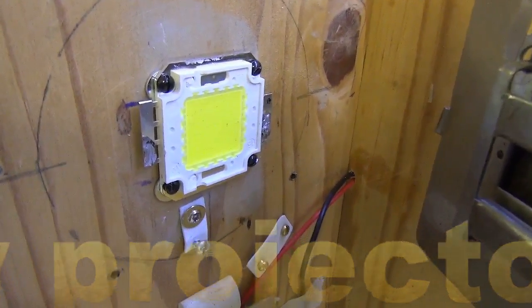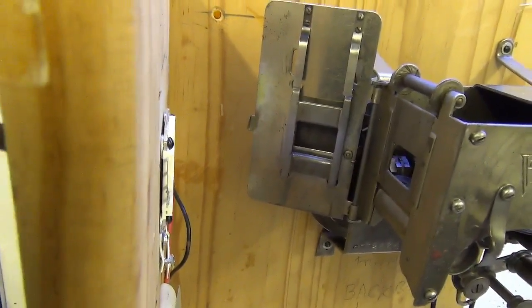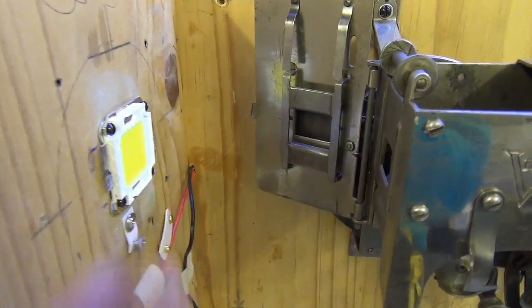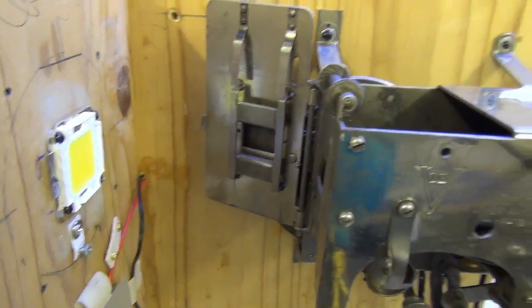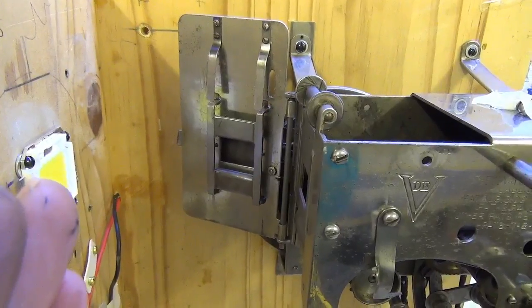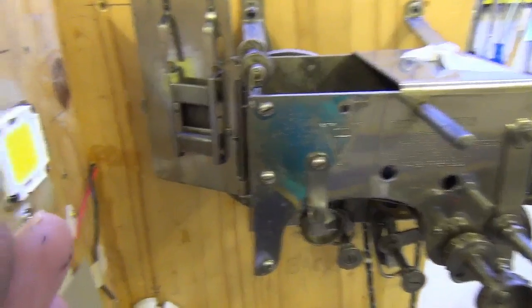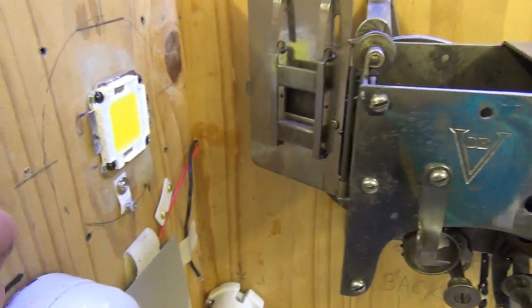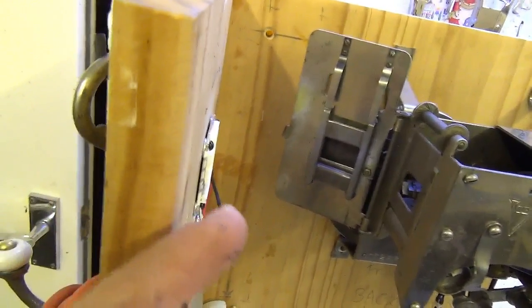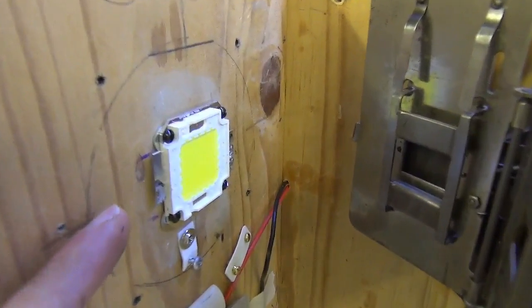And the LED unit will definitely need a heatsink on the back of it, which is going to bring it forward 14 millimetres because that's the thickness of the heatsink. And this means the lamp will be nearer to the condenser, which will be at the same position. And it's just possible that the light spread will drop off at the corners when we come to test it. If that's the case, I've got two options. I can either make a hole through this backboard for the LED unit to sit in,